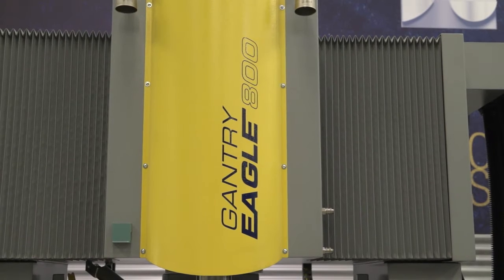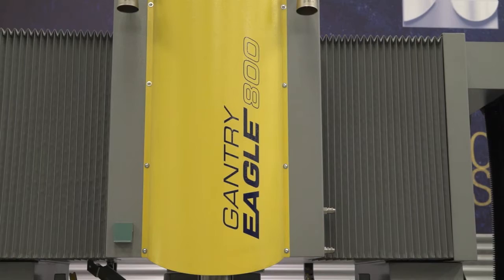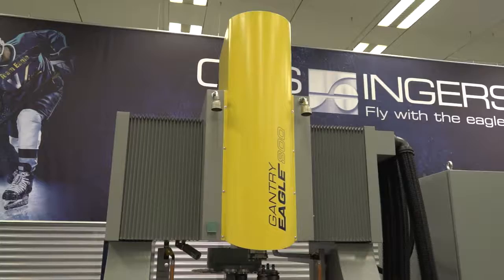Scott, the Eagle range of machines — the gantry style — why is gantry so important? OPS Ingersoll adopted a completely different philosophy from any other machine tool maker. Many companies focus on the C-frame design, which is actually a cheaper way to build a machine tool. But OPS Ingersoll work with small plug-and-play units right up to very large size machine tools.